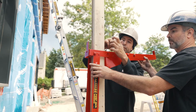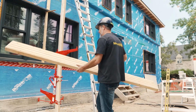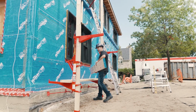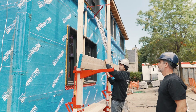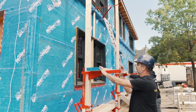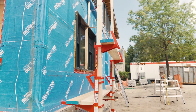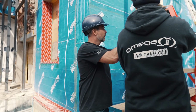Open the platform arms by fully extending them and installing your work plank securely in place. When choosing your platform, make sure to select a scaffold grade or equivalent lumber. We recommend using a 9-foot long platform with the pump jack system. There should be a platform overhang of 6 to 12 inches on each side. When overlapping platforms, it's required to have a 12-inch minimum overlap between the planks. The platform arms should be fully decked when using the pump jack system.